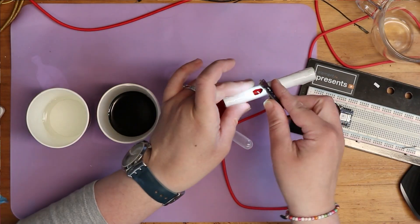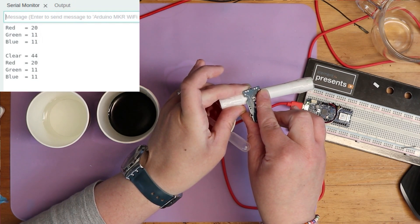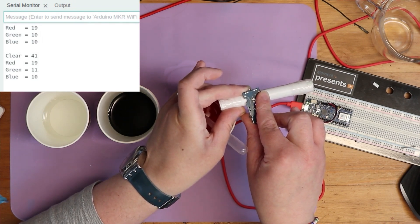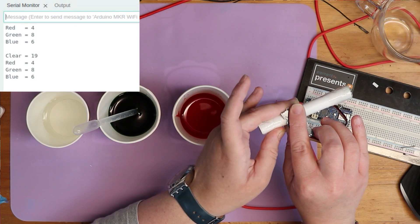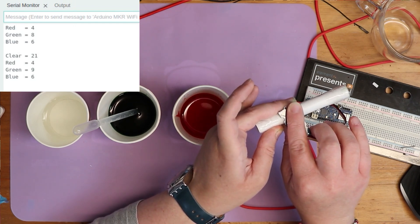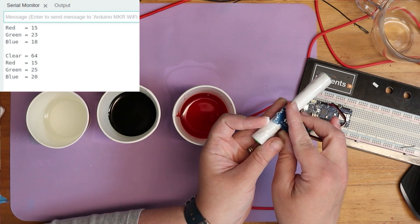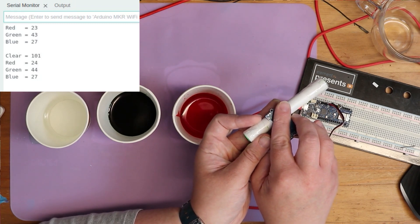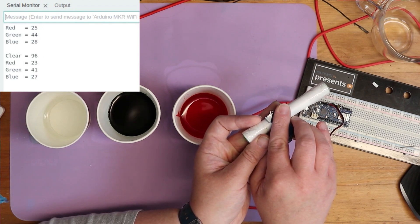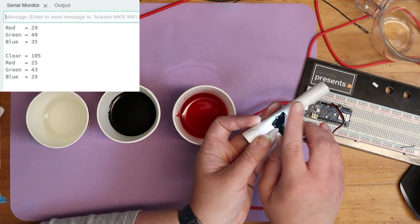The PCB is still quite exposed so I don't want to get it wet, so if I hold this over the water — on my reading I get clear 44, red 20, green 10, and blue 10. It's definitely picking up that it's got that red color. Now I'm going to try with the green: on the green I get clear 20, red 4, green 8 or 9, and blue 6. Now testing the clear — this has some of the previous test colors in it. I've got a really high value for clear of over 100, showing it's picking up the water with high values for red, green, and blue as well, but the water is looking fairly murky with the red and green mixed in.